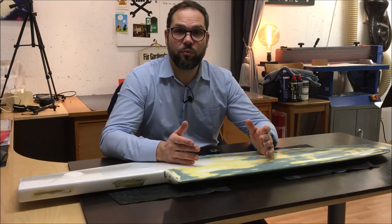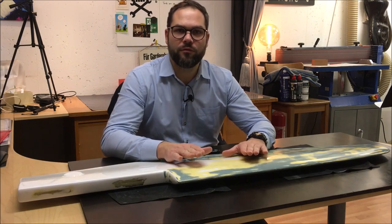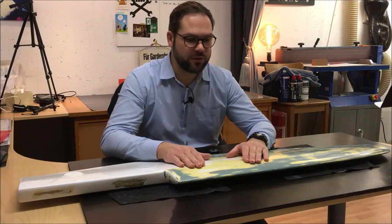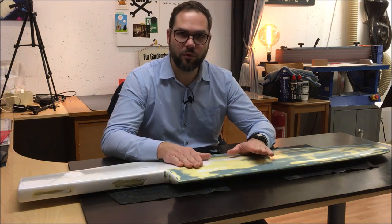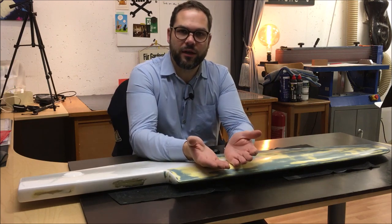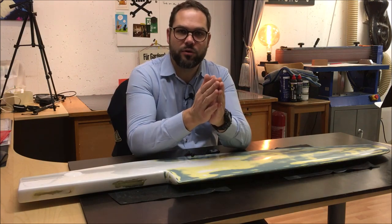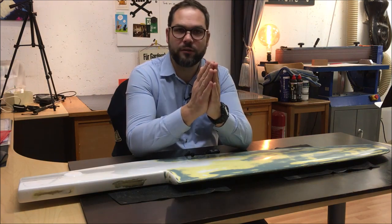In episode 4.2, I'm going to show you how to make a mold for vacuum resin infusion, because the new rudder blades will be produced in vacuum resin infusion technology using different layers of carbon fiber cloth, and this mold will be a split mold. That means we will create two halves, and these two halves at the end will be infused and the parts will combine together with special epoxy glue, and then the part will be ready.